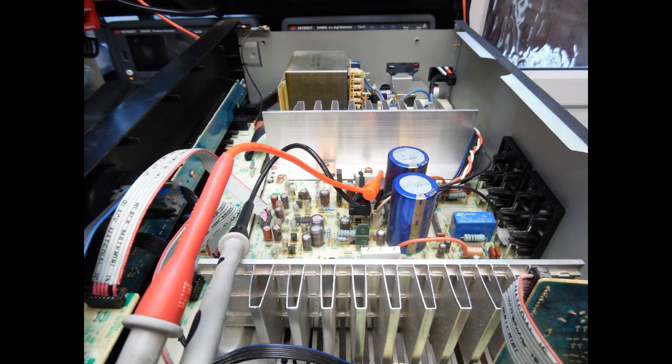Run this with no input signal connected, no speakers connected, volume control at minimum, and balance control at centre. Leave the amplifier to warm up — if the reading is a little high initially, just back it off; even five or six millivolts is fine during adjustment phase. Once warmed up for 10 to 15 minutes, adjust the millivoltage across the emitter resistors until you have a reading of 14 millivolts.